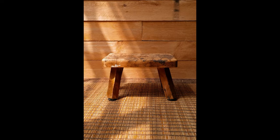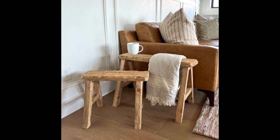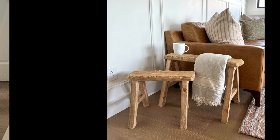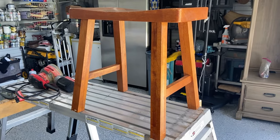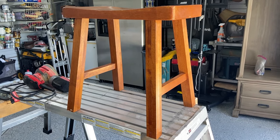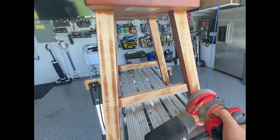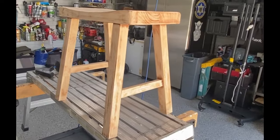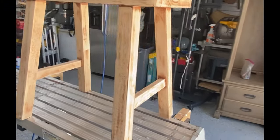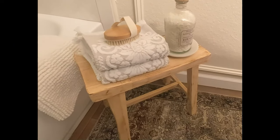Another item I've really been loving are these cute little vintage distressed stools — you can place a variety of objects on them or simply place one at the end of a sofa for a coffee cup. But they can be anywhere from $200 to $600. When I walked out into my garage and saw this old bar stool that's been sitting out there, I wondered if we couldn't turn it into something close. I had my husband cut off the legs and left it at about 18 inches in height. I then took out my sander and removed the old orange-looking finish with 80-grit sandpaper — I really loved the color underneath, so I just added some wax and left it as is. We got that Pottery Barn Magnolia vintage stool look for free.